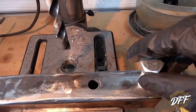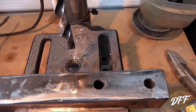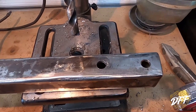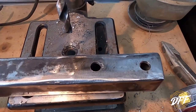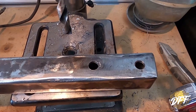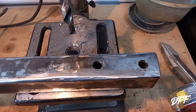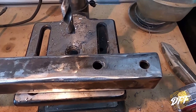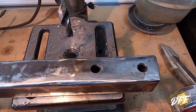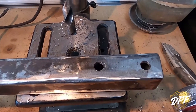Just like that, now we have our half inch hole for our bolt. The process of stepping up the drill bits obviously takes a little bit of time to continue to change the bits, but in terms of physical strain on your body — I'm using a drill press here, but the other holes I have to drill are on the trailer — it is a lot less strenuous to do the step method. Stepping with the drill bits little at a time, rather than trying to do one big drill bit at once. Keep that in mind next time you have to drill a big hole.